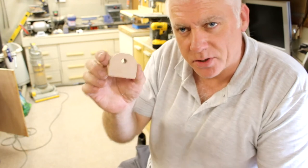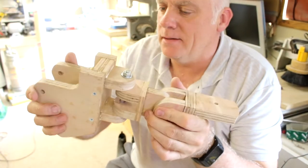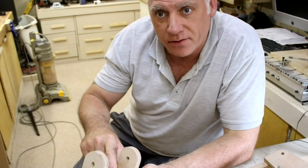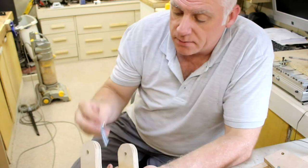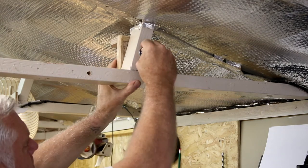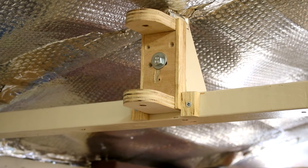I'm now going to attach two more knuckle joints to the camera mount. So I'll get this done now and then we'll get it assembled. Well, I've got the camera knuckle joints all assembled now. It freely moves left and right and up and down. All I did was I drilled an 8mm hole through the centre of the mount, and I put a T-nut on the opposite side. And I'm just going to wind a bolt straight in. Yes, that's more secure.